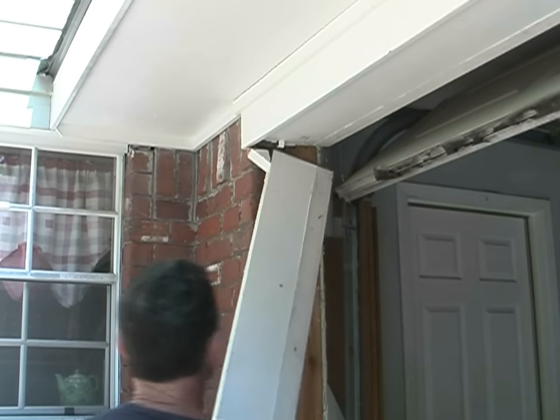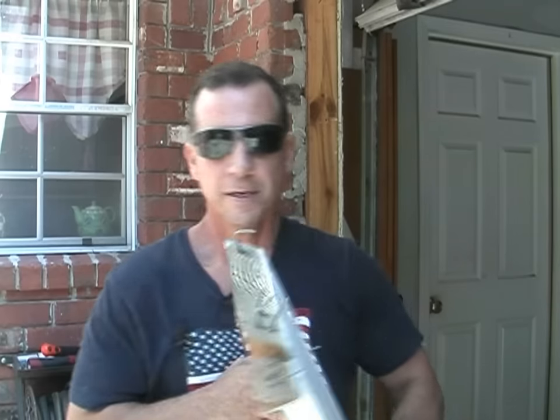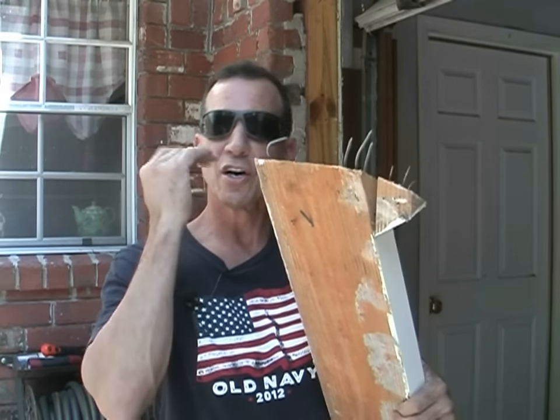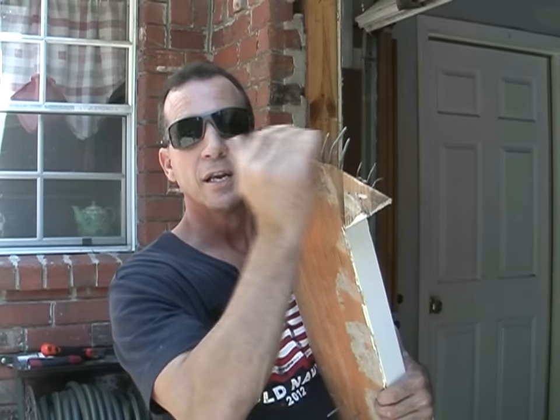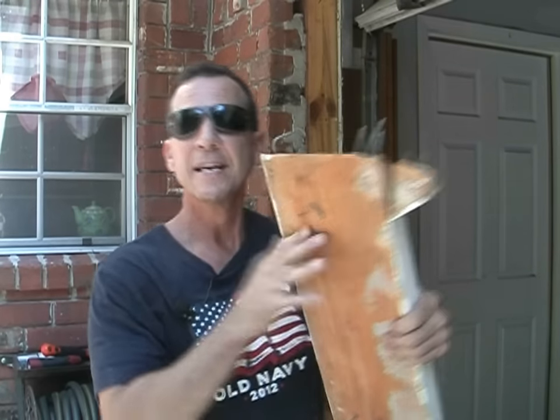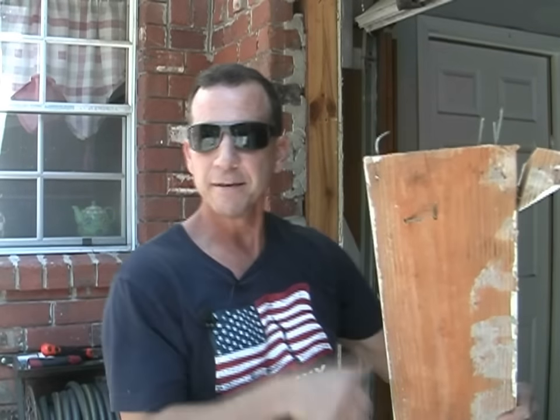She's ready. You see how this was behind it? It's mitered and there are seven nails in there. I could have taken my reciprocating saw and cut them, but then I'd have to pull the top parts off as well. If you can pry it out and get the whole thing out, it's better. If you can't, go ahead and cut them.